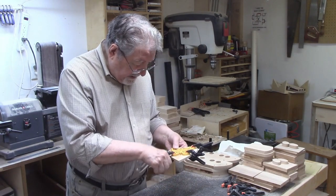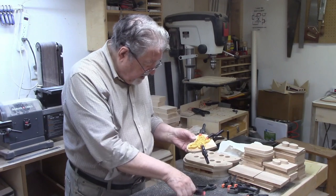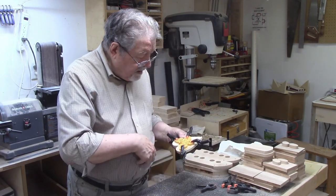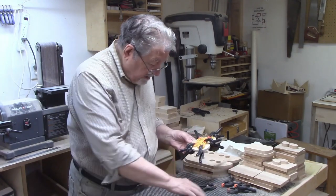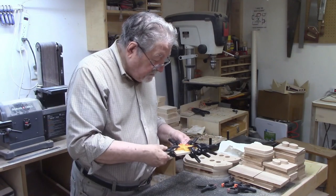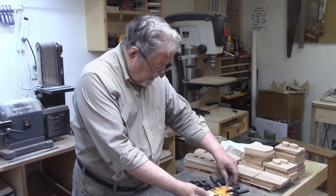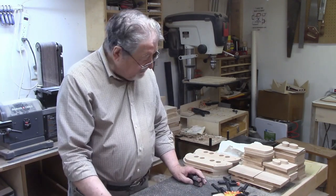I left some spring clamps on my workbench from my last project because I knew I'd be needing them soon for this. The top plus the butterfly is only 5/8 of an inch thick, and the spring clamps are perfect for a project like this. They're quick and easy to apply, and due to their size, I can spread several of them around the top. I doubt if I could have gotten more than 4 F-clamps onto that same space. I'll set this aside to dry, then I'll apply a couple coats of warm satin spray polyurethane.